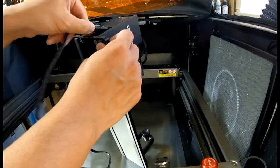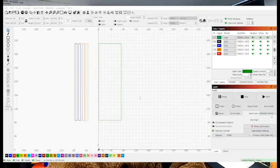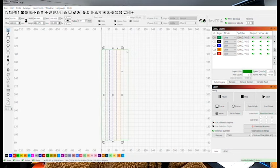The calibration process is pretty easy. You essentially draw a larger box containing five smaller, narrower rectilinear boxes. The height of these boxes represents the total circumference of the object, and the width represents the width of the can or round object you're measuring. I drew five smaller boxes and went through five iterations to figure out the perfect step value so the rotary rotates exactly as intended.